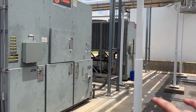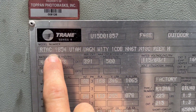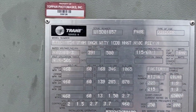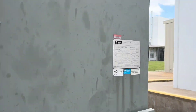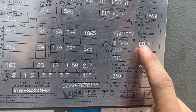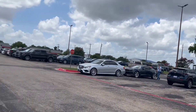These two RTAAs are the exact same size — both 185-ton. Here's the oil: it's Oil 48 since this is R-134A, so it's POE oil. Now walking over to the other one: also 185 tons, also Oil 48. So these should be the same. Now let me show you how much different the oil samples were — it gives me a little bit of cause for concern.